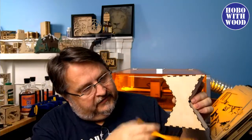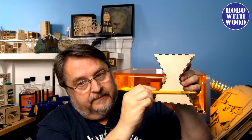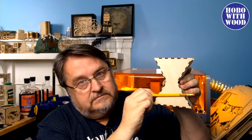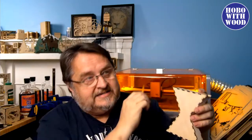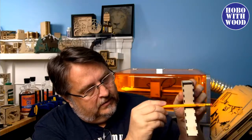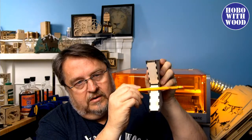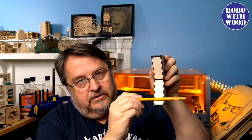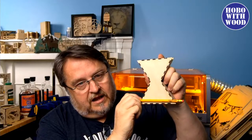And whenever I raise pre-focus that laser, if this is the perfect spot size right here, and I raise the laser, what happens to my laser beam? It got wider. But that's on my laser with its spot size. When you look at it on the X dimension, on the Y it is only 22 millimeters. When you raise it, what happens to it? Nothing. It does not change the width of the laser. It stays the same. But here, it gets a lot wider.